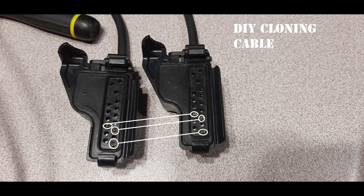Here are the details on building your own cable — it's a very simple cable to construct. Just get yourself a couple of populated Jedi Universal connectors from speaker microphones, programming cables, or something of that nature, and make the connections straight through as shown. I hope this helps. This is Brett from Survival Comms — till next time.